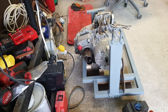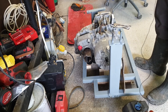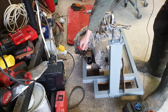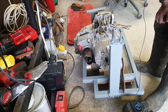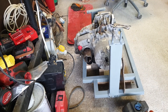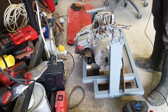Basically when we're driving forward in our Muskvo, this drive unit will be running in reverse, but that won't bother us — with the open inverter control we'll just run it in that direction. In terms of horizontal positioning relative to the original half shafts in the engine version, we are five millimeters further towards the front of the car than they would have been with the gearbox. The reason is we want to keep as much of this material as far forward as possible, and I don't think five millimeters is going to cause any difficulties.